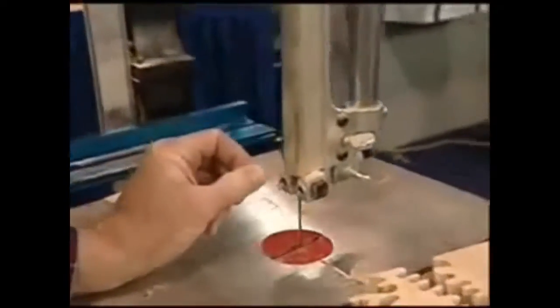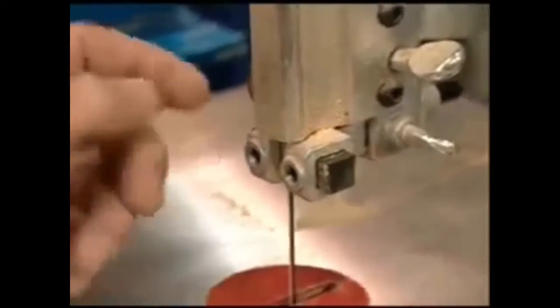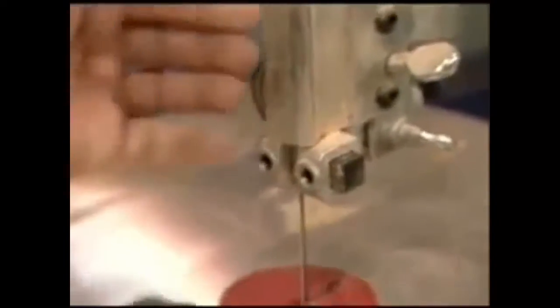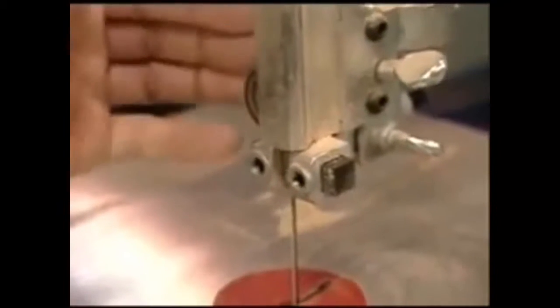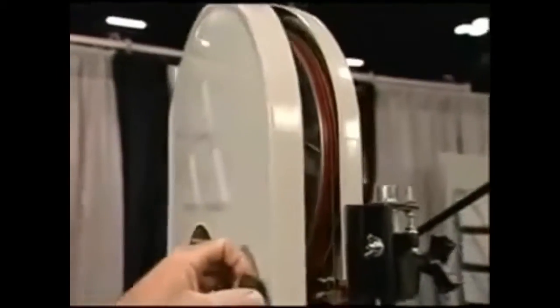In other words, if you come around here to the front, look at this — you can just barely see the front of the set of the tooth sticking out of the front of the guide block. You always have to have the thrust bearing adjusted above and below the table to help support it. And then the blade needs to be on the middle of the tire and tensioned properly for those cuts to work great.